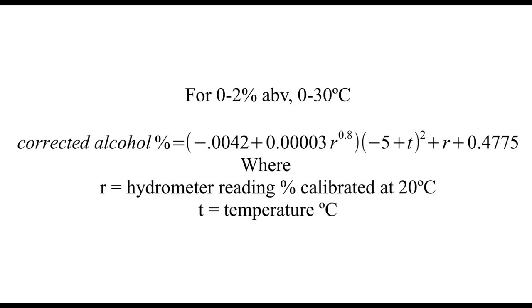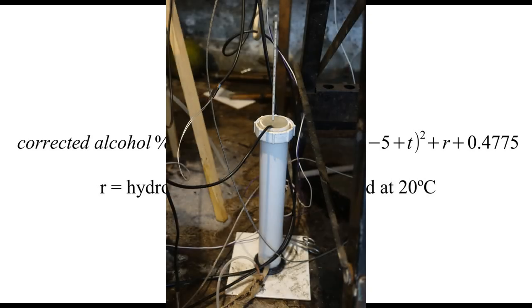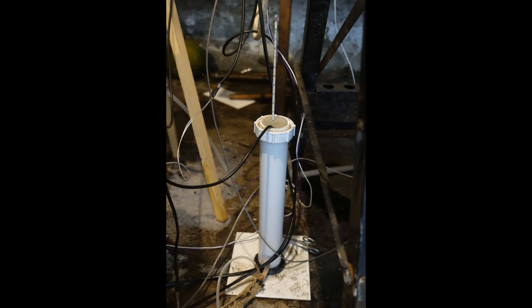We are not concerned with evaporative losses this time, and even though the parrot is larger than the spirit one, it will fill more quickly because the bottom's flow rate is higher than the spirit flow rate. Wash is usually between 5 and 15% alcohol, and with the steam there's about 10 times as much bottoms as there is spirit.